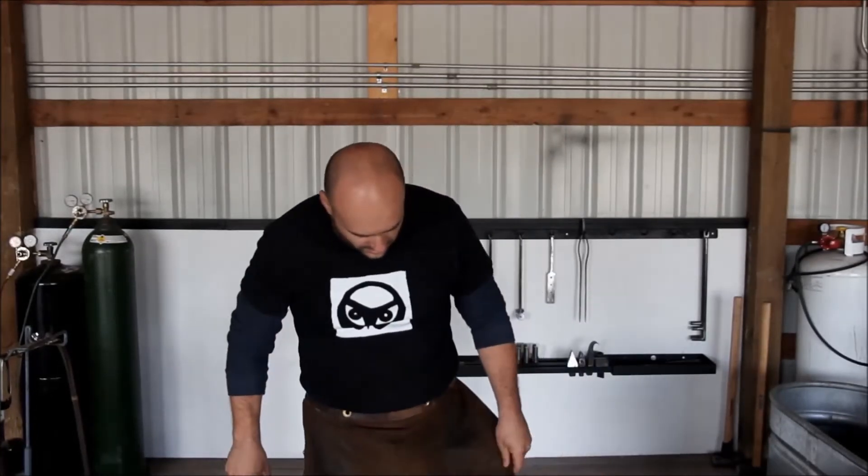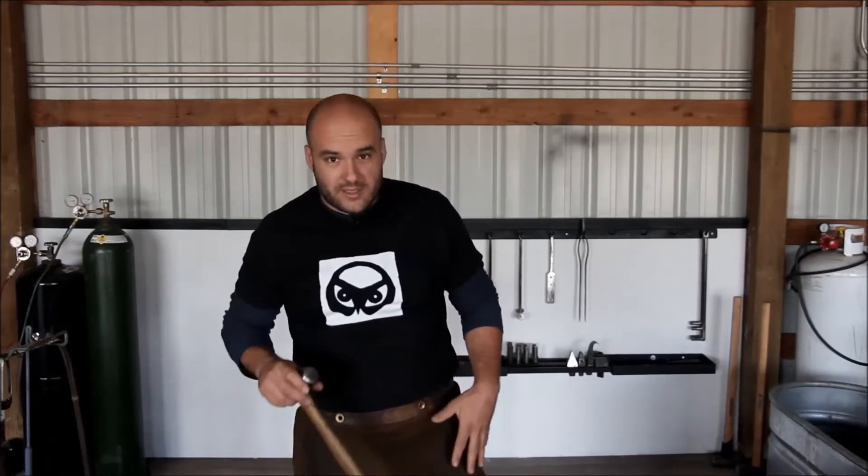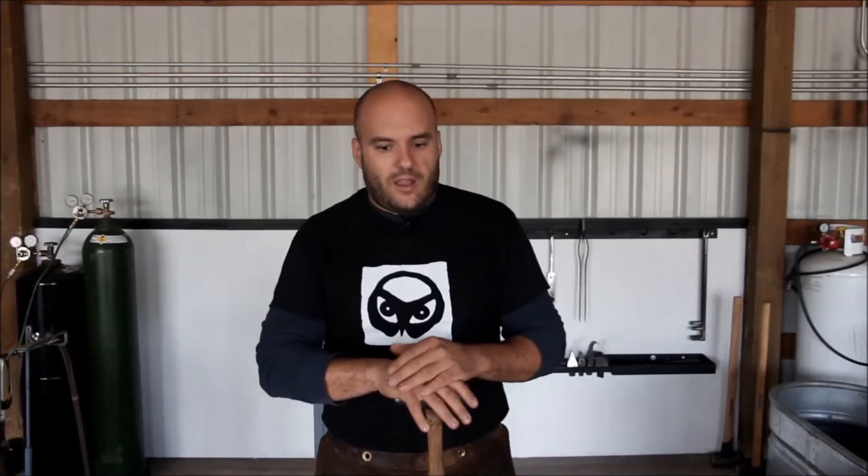In addition, I also wear a leather apron to protect my pants and my groin area. I also wear hearing protection and eye protection — hearing protection obviously to prevent hearing loss from loud noises, and eye protection to protect my eyes. Especially when working in a horizontal position at the vise, hot scales can pop upwards and hit my eyes, so that's a very important thing.